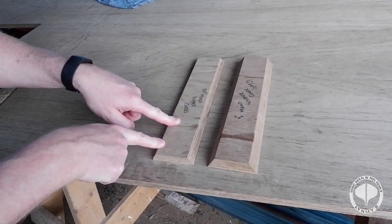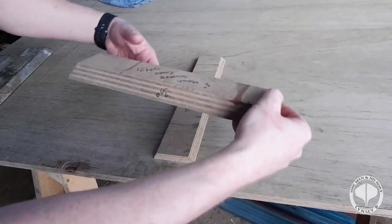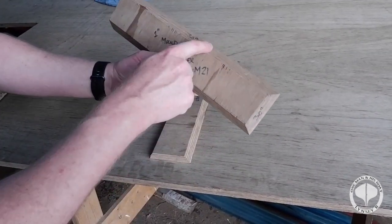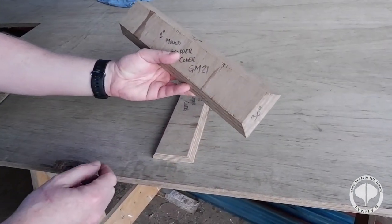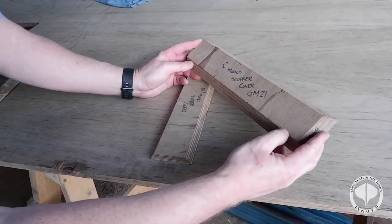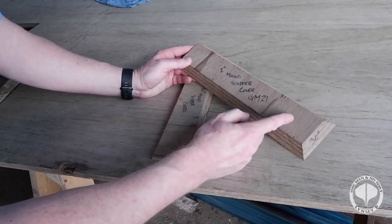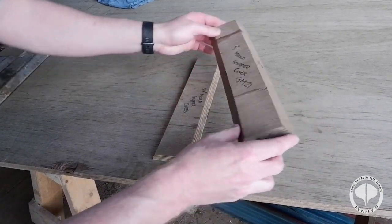Obviously that was my first attempt with a 3/4, and this is the inch. Now what I've done, just for my own peace of mind, is mark the degrees of each angle. Each angle is 30 degrees, and that should be enough to let water run off once they're on the boat. Now, obviously they're actually longer than the scupper. This is 300 mils long. Obviously the scupper's only 250, so you have a good distance between each end.